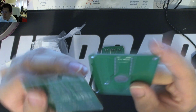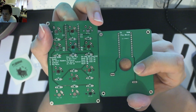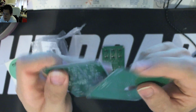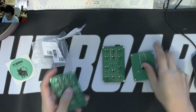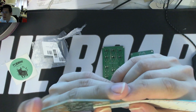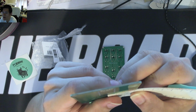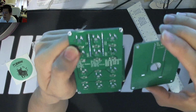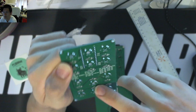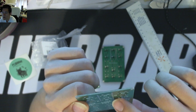So it's pretty cool. Now if I'm just comparing them, apples to apples, the thickness and the width of the traces look very, very similar. I would hazard a guess to say that the boundary between them on the PCBWay is actually possibly even slightly thinner. So they're about 1 mil wide from black edge to edge, whereas on the AllPCB one they're just a smidge bigger. So I guess that just means you could probably route your traces a little bit closer because the tolerances they've got here are probably a bit thinner.